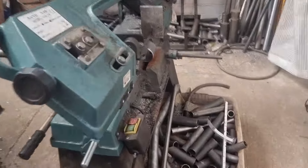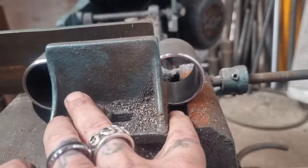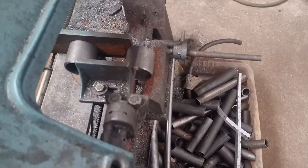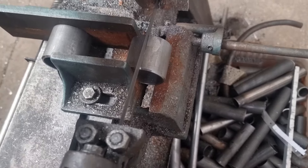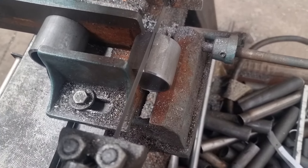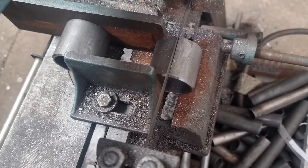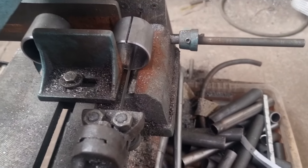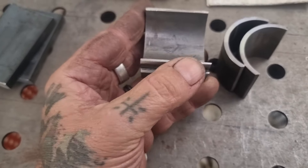Right, next up we're going to split these wings. They sit nicely in this cutout on the saw, so that marks centre for me for the first cut. We've got the other one in to hold it, and we can get this cut through in short order. Once they are cut I label them up and they stay as a matched pair — so these two will always stay together. Then we cleaned up and weld prepped on that cut edge.